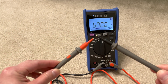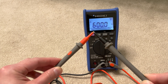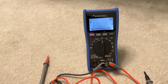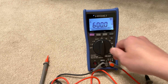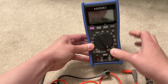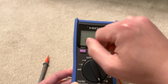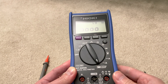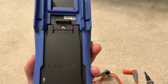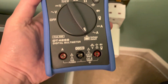The other great thing is instant beeping when you measure continuity - that is so handy when tracing faults and doing that sort of measurement. One last feature to point out is voltage detection: you take the meter and when you move it close to a live cable it beeps and this LED lights up to tell you it's in the presence of high voltage potential. Let's do a quick test of the voltage detect function - yes, that's what it does.